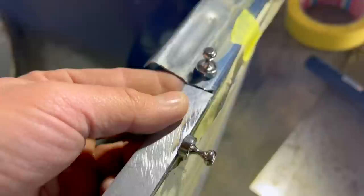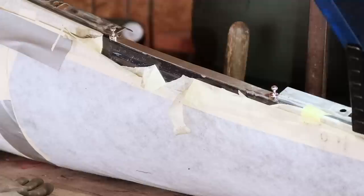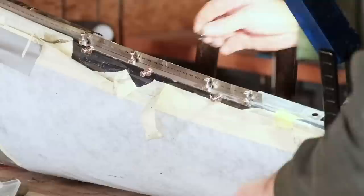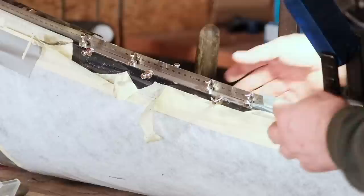I think you can see where this is going. The repair panel needs to follow the curved edge of the fender, obviously. And in order to get the cross section right, I decided to divide the entire thing in two pieces. A flexible ruler and magnets would allow me to mark the first panel in a way that the curvature would harmoniously match the body line of the fender.